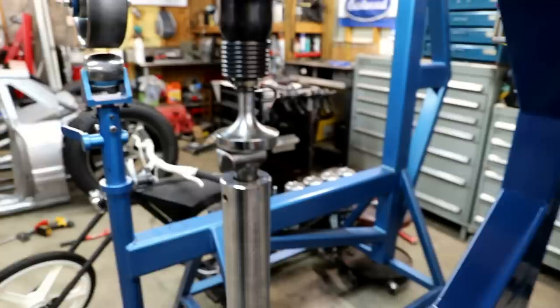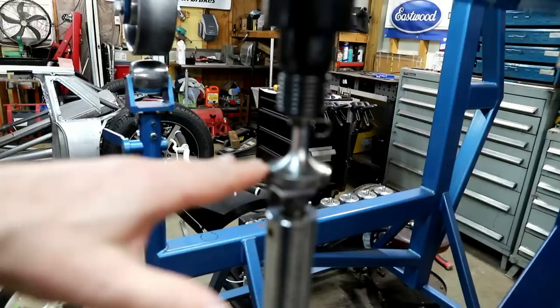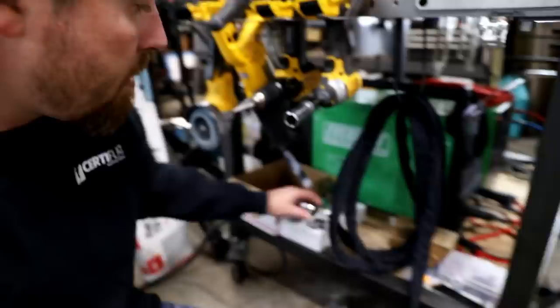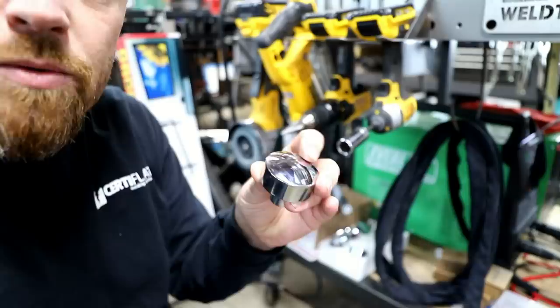There are five trillion reasons why you might want to shrink or stretch metal. The particular reason I'm talking about today is probably the easiest form. So this is a planishing machine — basically it's an air hammer. This upper die just goes up and down and oscillates really fast, hammering the metal. Then you have a lower die that it hammers that metal against. Traditionally the lower die looks something like this — I've got a bunch of different lower dies with all kinds of different radius domes, some pretty flat, some more domed.